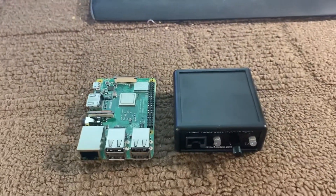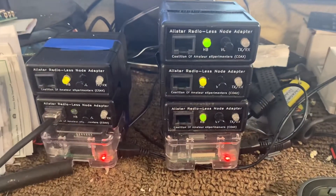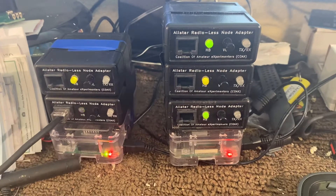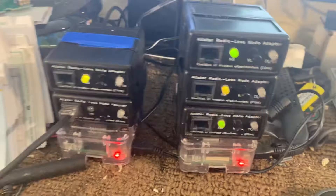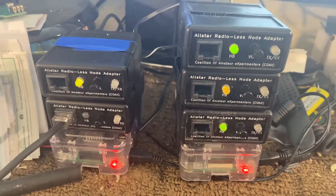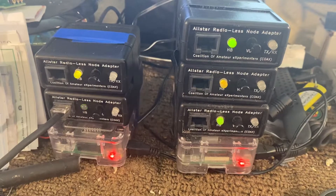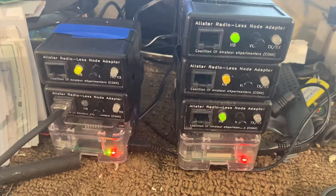I love to use these as a base station where I can't put antennas up, and here's five of them running right now. The current limit on a Raspberry Pi 3 is three nodes running simultaneously, so I've got two Pis here running five different connections at the same exact time. I don't use DTMF to command my node to different locations — I just know where I want to go for these five, so when they boot up, they automatically connect.